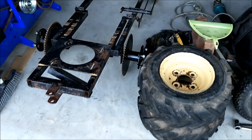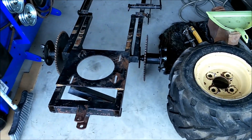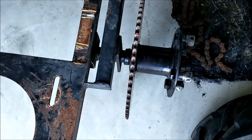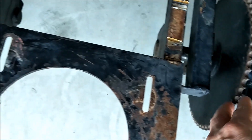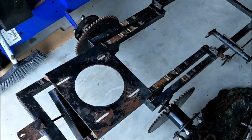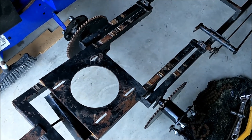Last night I stripped down the wheels and did a little bit more cleaning on the frame. The bearings in here are not particularly great — they're okay, but while I've got this far apart I may as well put some new bearings in. These cogs are a little bit worn on the teeth on the side, same on the other side. I think it's mostly through chain misalignment. I was thinking about reducing the size of those cogs, but it seems I'll actually need that full diameter, so it's a good thing I didn't start cutting them.